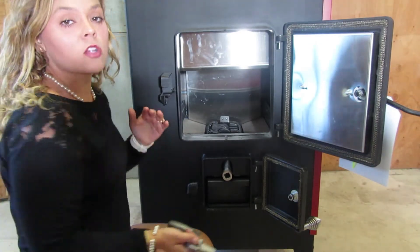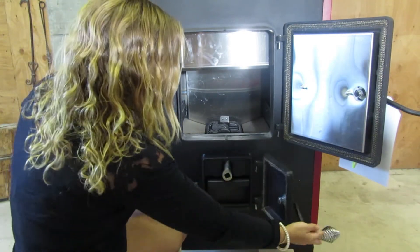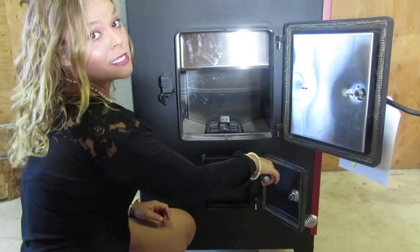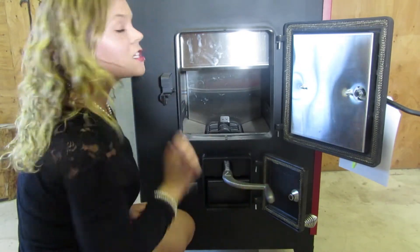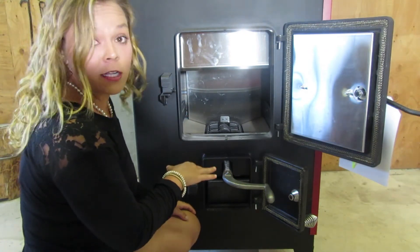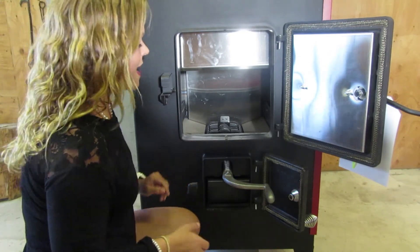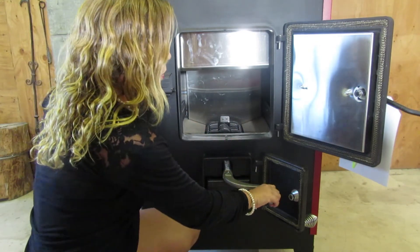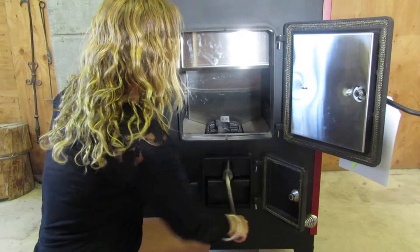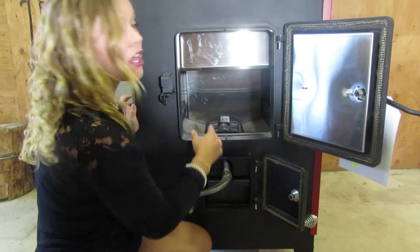Inside the firebox we also have a roller grate system. They give you this handle to stick in here — this is behind your ash door. Underneath your ash door you install your handle, and this is how you use your roller grate. It literally spins completely around in a circle. This is especially nice to have when burning wood — it's not usually a standard feature you would see on a wood burning furnace. Fire Chief is one of the few companies who actually does this, and it's an upgrade over their base model, the 1000. This roller grate allows you, once your wood is most of the way burned down and you have coals, to shake out excess fly ash that builds up in your firebox. You just give it a quick spin, the fly ash and excess ash will fall down, it shakes your wood coals out, and then you can reload your furnace.